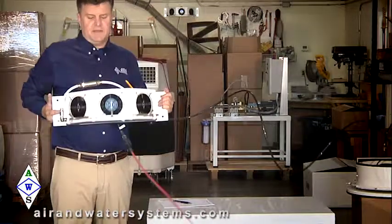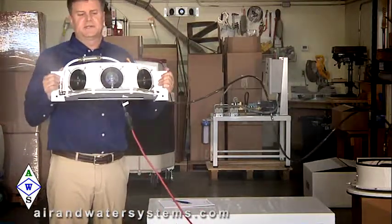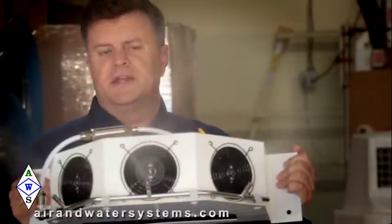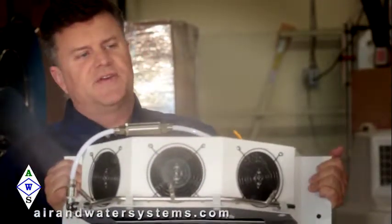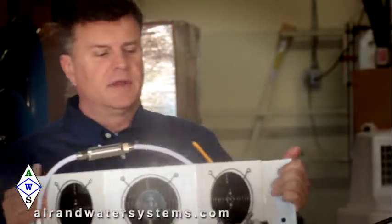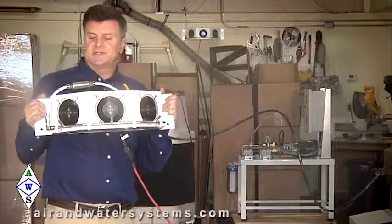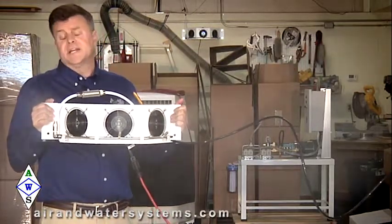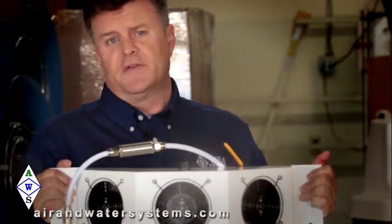And again, this would be mounted on the wall. But you see it's a very nice, very good shape water coming out. And it's got enough spacing and enough fan behind it that it's going to flash evaporate very cleanly out into space. Now, obviously this would be hanging a little bit higher, but still there's going to be no fallout on the floor. Each one of these fans is very low energy. It's a computer fan basically, but altogether it's less than 1/2 amp of power. So that's very low energy on 120 volt, 1/2 amp.